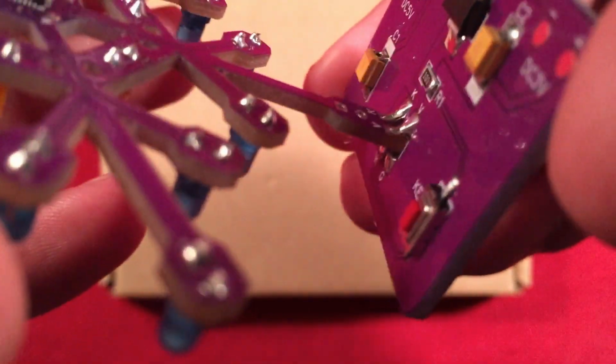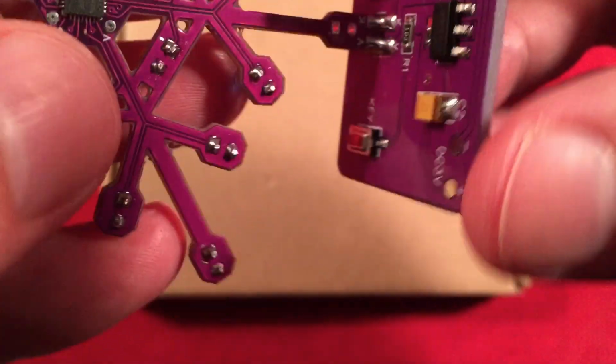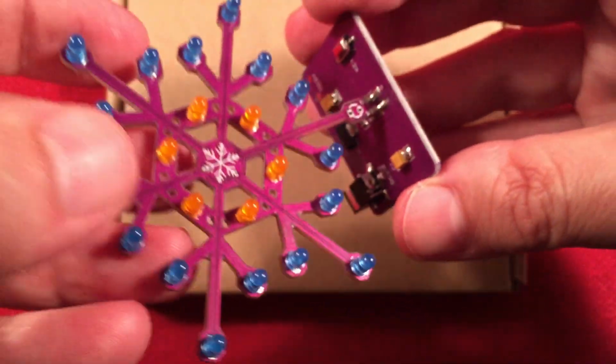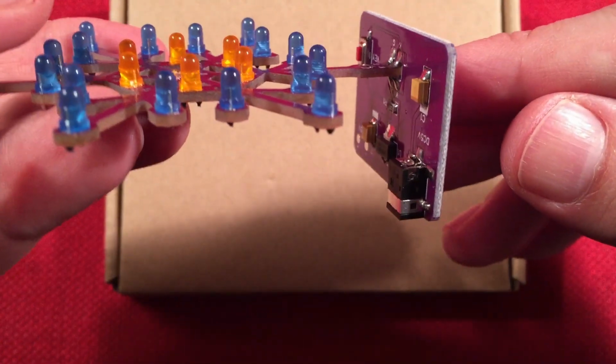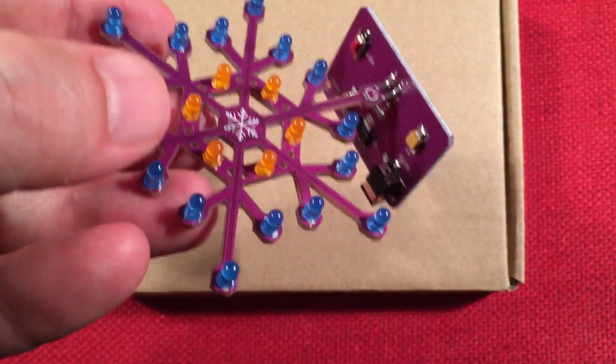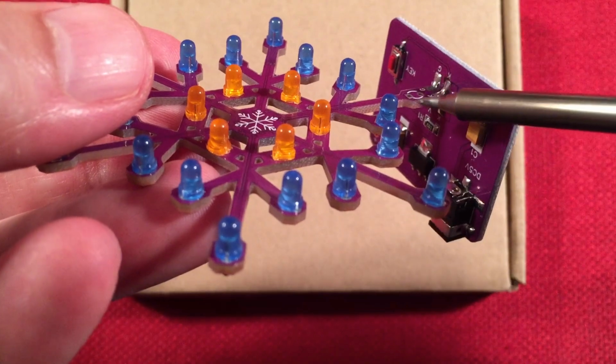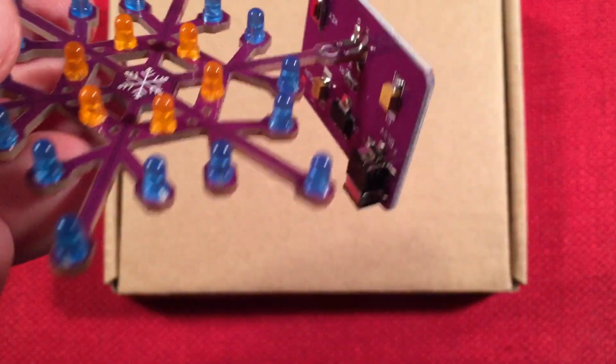What I found was adding solder to each pad, and then a little bit on the tip, and then filling it in, and kind of using gravity. I'd hold it like this, at a 45-degree angle, and come in with the iron like this to heat it up, so the gravity kind of fills it in. That's how I did it. Worked out well. So there it is.